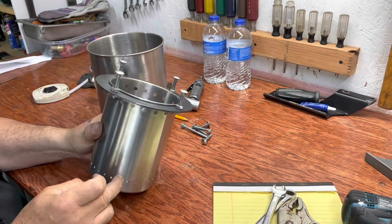It comes in the big holes. It goes in here and some of it comes up the side of this and re-enters through these holes. And what it does is combine with the gas that's not burned at the level of the fire, and it burns. And little tiny flames come out here, and you can tell it's working when the flames start up here. So you're having a complete and total burn.